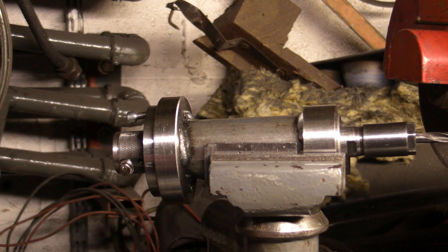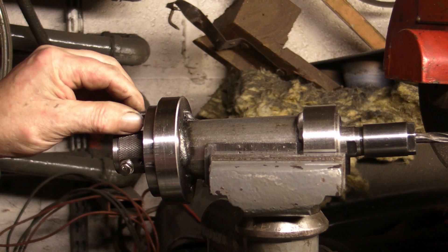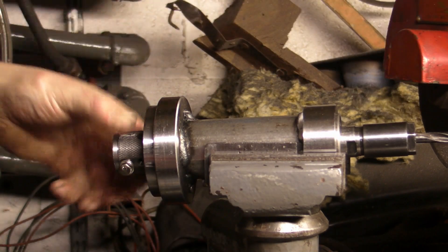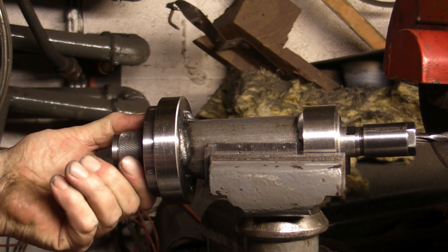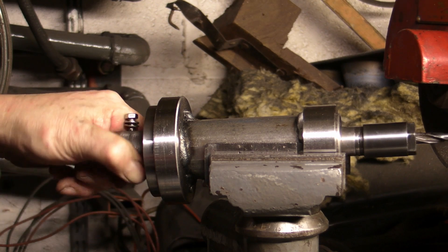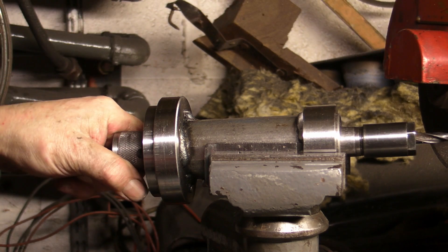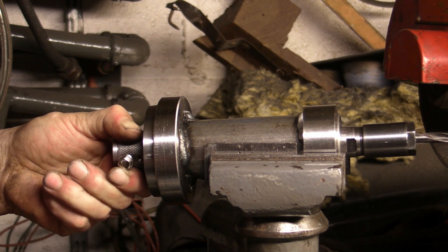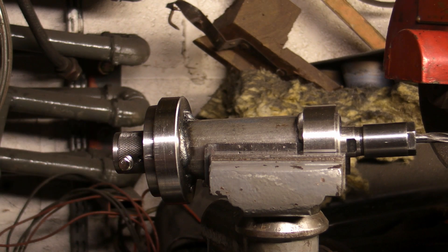Well, this time I'm going to try without the locking pin in at the 180 degrees, and once I've got the initial grind on I'm going to start spinning this spindle round 360 degrees to see if that gives me the required clearance at the back of the cutting edge. So I'm not sure this is going to work or not — we shall see.